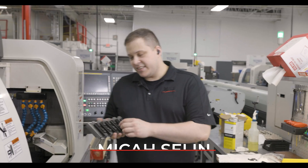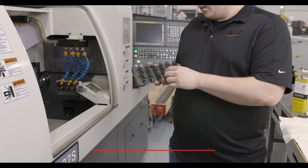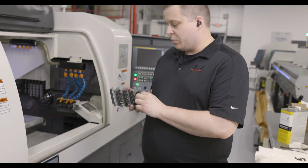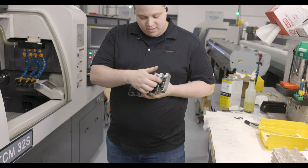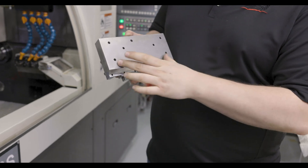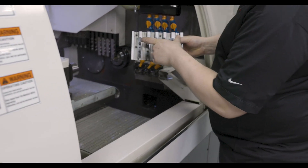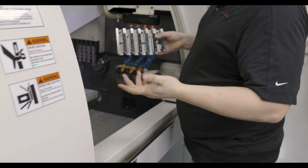This is the OEM gang plate for a KSI TCM. For the install between the Arno gang plate and this, all it takes is six bolts that go on the face, and then for alignment you have these holes for a tapered pin. What I like to do is loosely put in the bolts into the gang plate, then use the tapered pins to drive it in, line it up, lock down your bolts, and you're done.